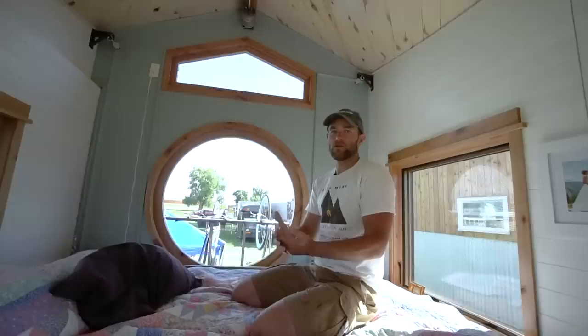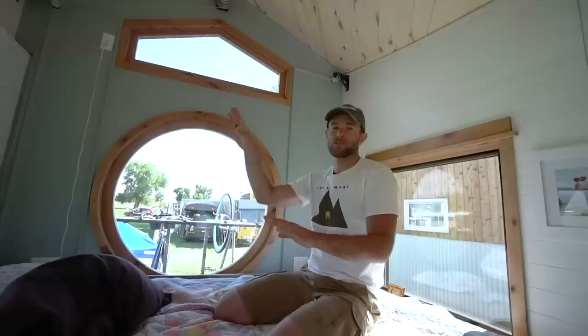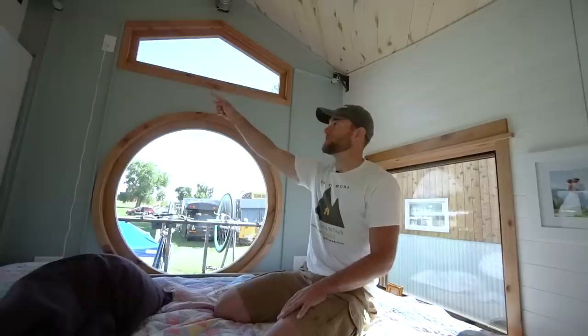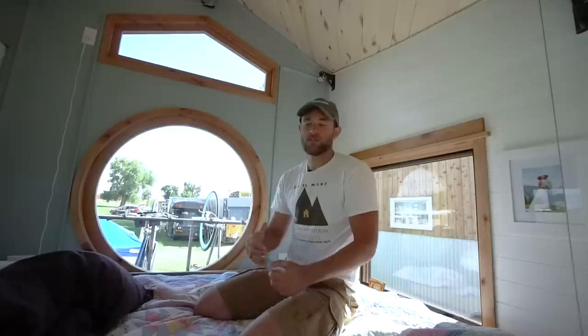The back wall is actually just quarter-inch drywall. We have SIP framing — it's a panel construction with OSB skins on both sides. We're not having to try to hit studs everywhere, and that's one of the main reasons I like SIPs. It gives you a solid substrate in the entire house. That made putting these brackets up easier — I can screw straight to those SIPs. You just have to use coarse-thread screws. The SIP company gives you numbers: pull-out is 250 pounds, shear is 1,000 pounds. I've got like 10 screws per bracket, so I know they're going to hold.